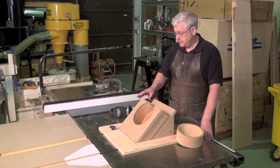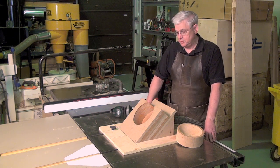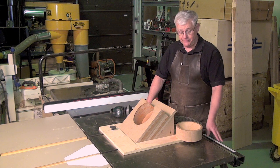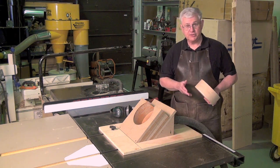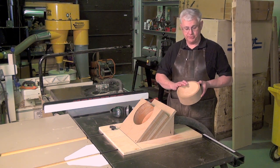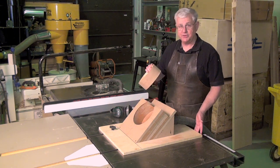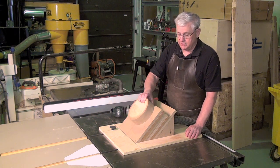In preparation for the coping cut, I changed the saw blade back to a ten-inch saw blade. I've used all different types and find that only two give a very smooth finish that eliminates a lot of sanding — the triple grind and the rip. I'm using a rip saw today. Place this into the jig, again aligned with the back of the saw. The saw blade is down below the level where it will contact the wood.